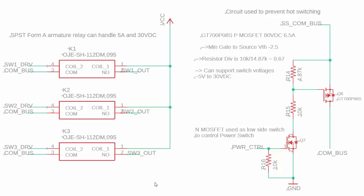Now let's look at how to prevent hot switching when using mechanical relays with a constant signal applied. Hot switching is when you actuate the relay - either close or open it - when there's power applied to the path. When the relay contact is almost closed or first starts to open you get arcing, which wears down the contact points, shortens the relay's life, and increases contact resistance over time.